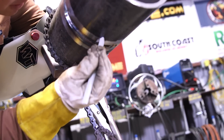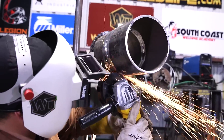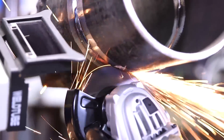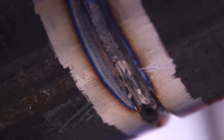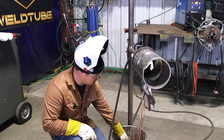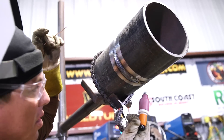This will help me identify when I go to grind it. The way I'm going to repair this is I'm going to grind it very, very thin. Then I'm going to go back over it with some 3/32 wire running slightly hotter. Got that all ground down nice and thin. I'm going to turn up our machine to 100 amps and get a 3/32 70S6 wire.